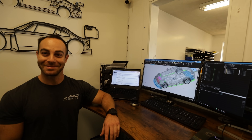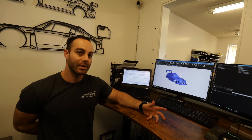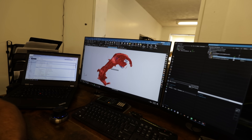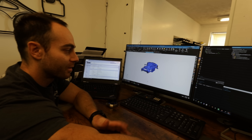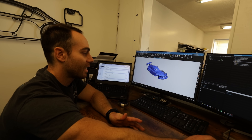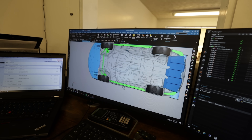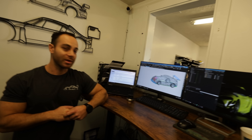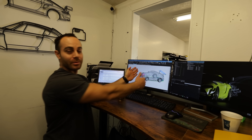Your car is so different we literally had to scan all of it — ground up, everything all over again. How many hours does 3D scanning take? Generally between four and eight hours; yours was probably around six overall. It went together pretty well, and I didn't have to do much of the underbody since it's flat — I just grabbed that plane and we're going to flatten it all the way over. I gathered all the data for your diffuser. We grab enough data to find a centerline and then mirror it. Your car is actually easier in that respect because it doesn't have a transmission tunnel or exhaust due to the EV floor.